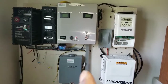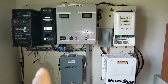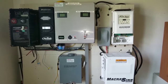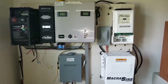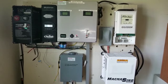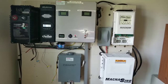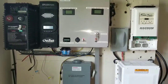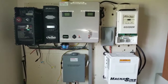I need to move the command center a little bit that way to the gray disconnect over there, so I can get a little room from the inverter and the charge controller. Because if it's running — especially if it has to charge the batteries — they get warm. There's a turbo fan that cools the system, which sits right in the center by the FX 3048. You can see that turbo fan right there, and it's going to be okay.